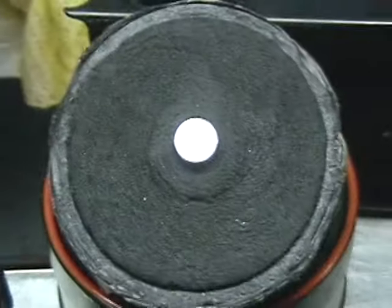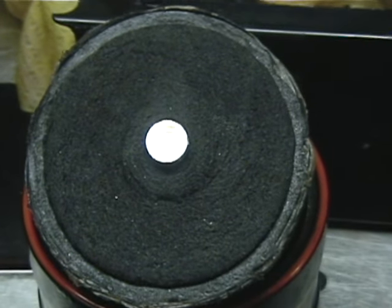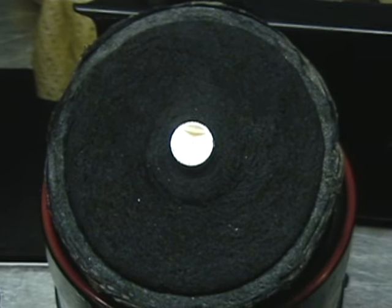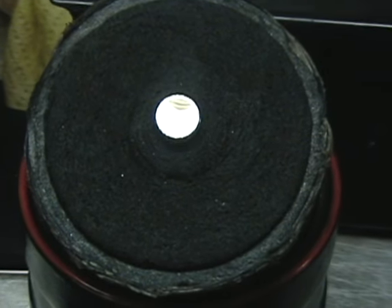But as you can see, the oil is thoroughly blackened — it transmits no light. My bypass filter element is completely plugged. By the time I got back, there was essentially no oil going through the element to speak of.